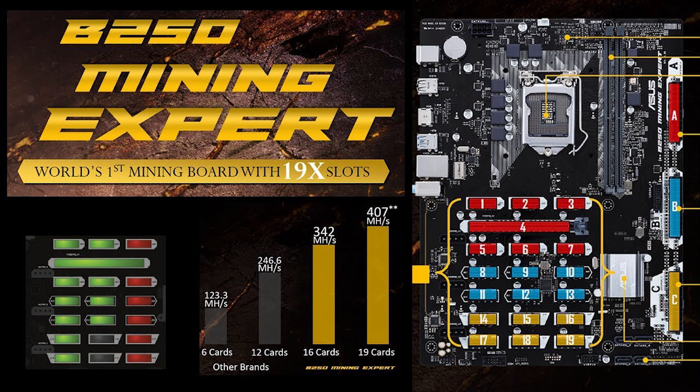You can usually check this info on ASUS's website, but at the time of this unboxing, ASUS hadn't officially listed this board on its website yet. The B250 chipset does require DDR4 memory, and we recommend 2133 MHz — it's the most compatible with all the processors that support it.